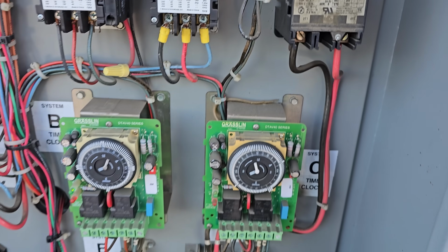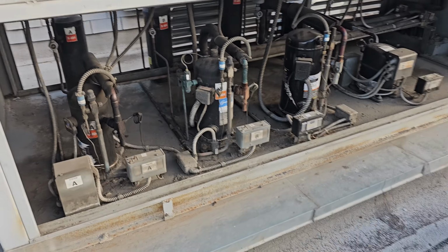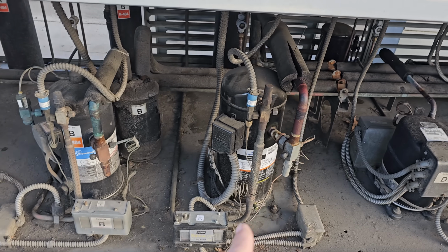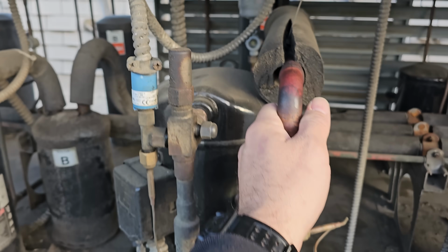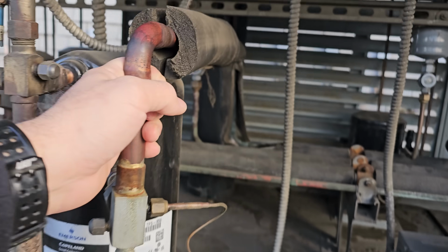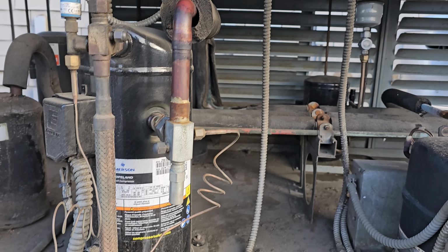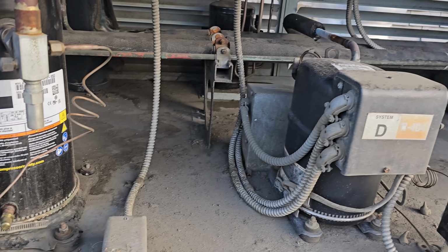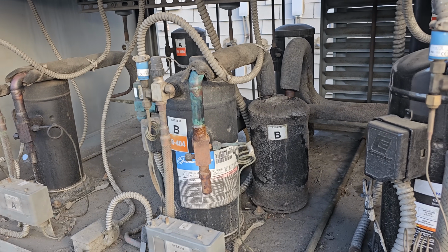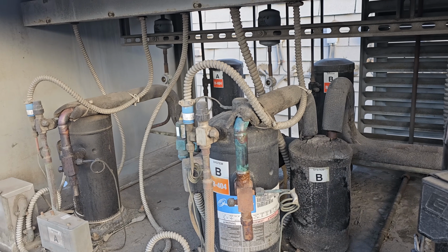Interesting, okay. I don't see anything crazy here. Let's come on over here. We've got 3 compressors, walk-in cooler, walk-in freezer, beer walk-in. It's running. Clear sight glass, which is typical. Rack. It's pretty dirty. Not like plugs, but the rack's dirty, that's for sure. Okay. Well, let's head downstairs and see what my thermometer says compared to the digital thermostat.